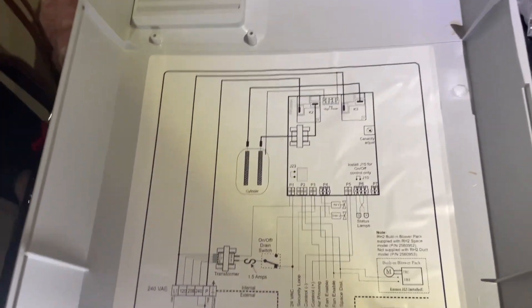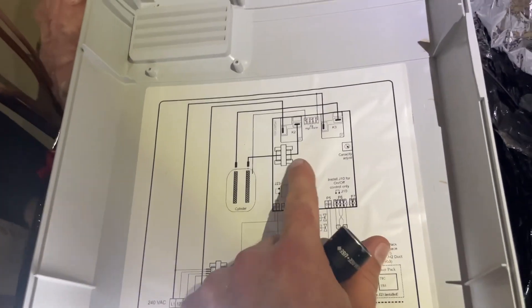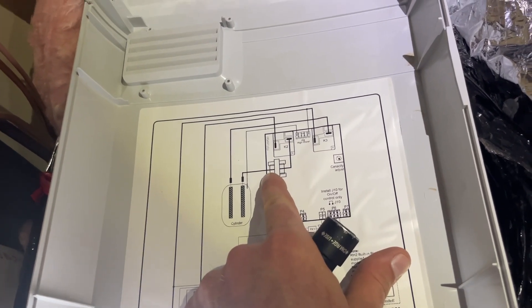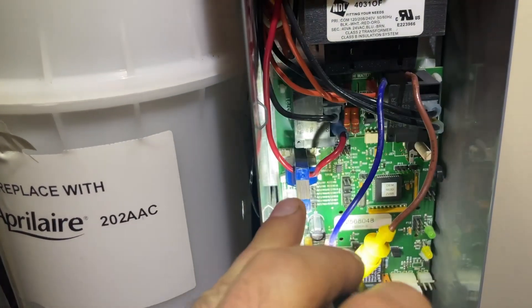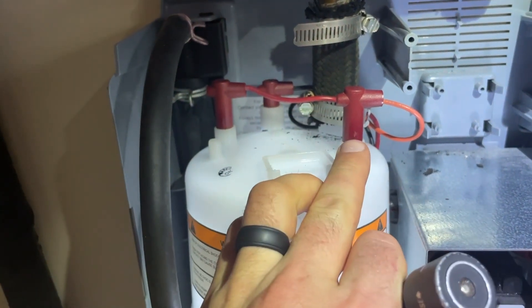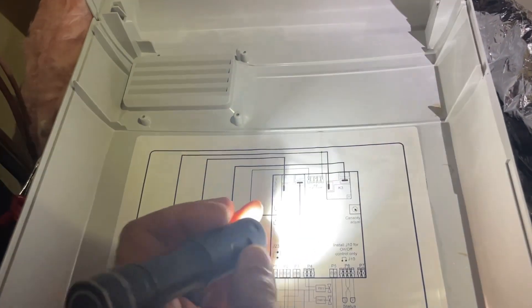Now what kind of manufacturer does a schematic with no wiring colors? That is unacceptable. But we've got just your typical relay here going through a CT, and that's going to be this guy right here. Now we're going through a CT, so my black and red — those are the power wires. So this orange here has got to be the sense wire. And if it is, it's going to come up onto that terminal block. This wiring diagram is very bad.